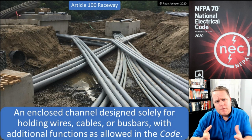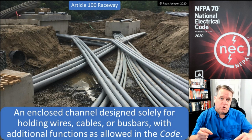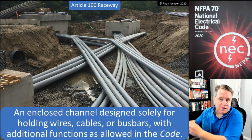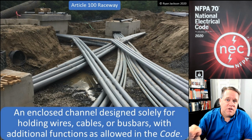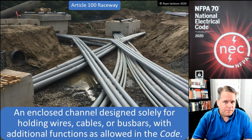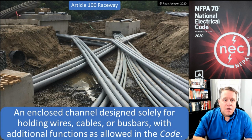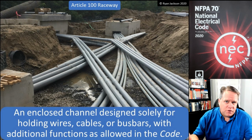So if you're not familiar with directional boring, that's where you drill a hole into the earth, and there's kind of a remote control apparatus that controls the drill head, and it pulls a conduit behind it as it goes. If that conduit already has wires in it, we call it type NUCC, non-metallic underground conduit with conductors. If it does not have conductors in it, we're almost certainly installing HDPE conduit with the directional boring equipment. But anyway, a raceway, it's a piece of pipe that you put wires in, generally speaking.